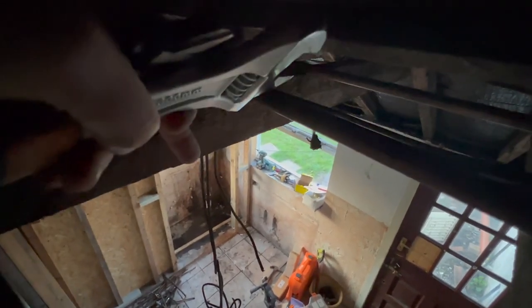It's a bit hard to see, we're losing a bit of light, but here and here we got our hot water, cold water feed, which was the taps, which I've now capped off. Same sort of thing, I went down in the corner, cut the bottoms off down there, let them feed out into the bucket, trimmed them off slowly, and then I've come back down here, snipped them, and capped them off with stop ends, just like I've done with the microbore 10mm.